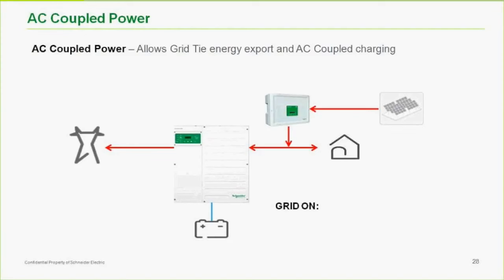This is why, when we program it for AC coupling, we're off-grid now, programmed for AC coupling, which means that when the grid is not available and the battery voltage reaches a set point or target, it then shifts the frequency up to signal the grid-tie inverter to slow down. So now, does it do that in a three-stage fashion? Yeah, I believe it does. I believe that's something that's new. I'm not 100% on that. Okay, I'm getting a yes on that. Yes, it's new. Okay, good, I am right on that. So yes, it will do three-stage charging off-grid with an inverter that will listen to it.